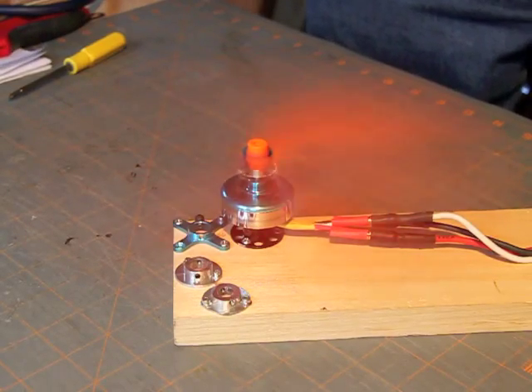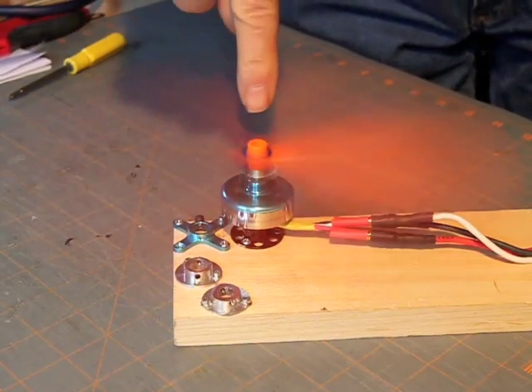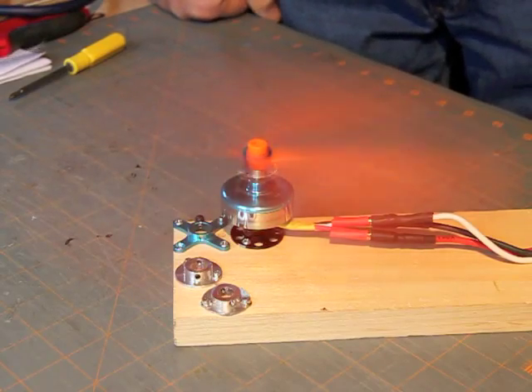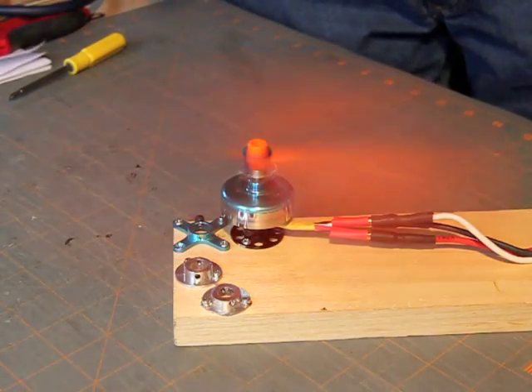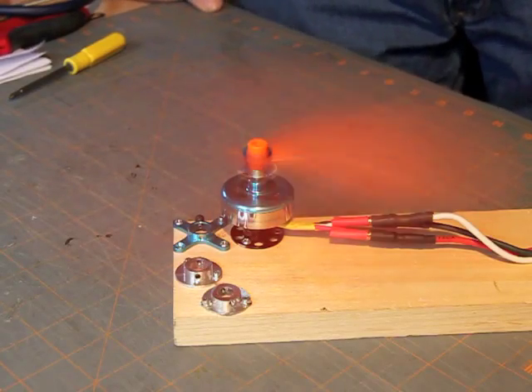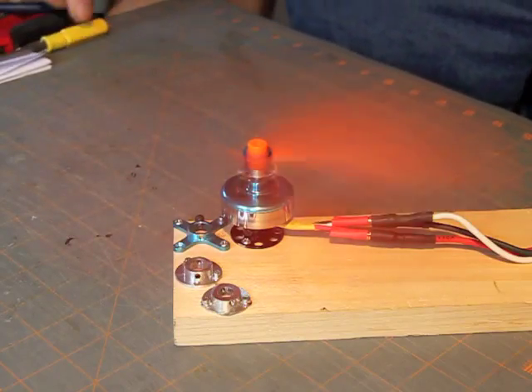There we have it. What you want to look at is that little center hole right in the middle — it should show very, very little if any movement. The outer hub is slightly eccentric, but the point of precision is that center hole. That's running very smoothly there, 1500 RPM or so probably.